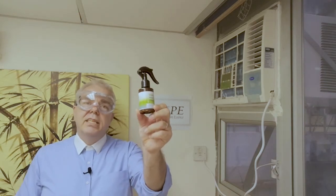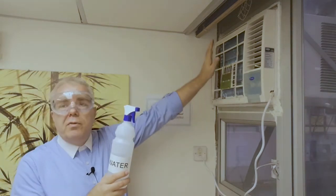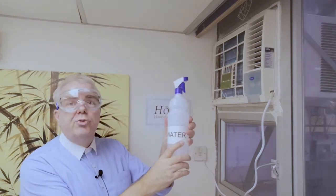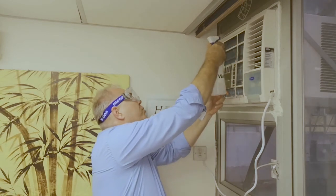Now we are back. This is Richard again. We are now ready after 20 minutes to clean your aircon. One thing I forgot to mention is that in the bottle, although it's 100 ml, you actually have 10 ml of tea tree oil inside — that is natural and helps you clean the aircon. But we have already sprayed it, so now we just use normal water to finish the cleaning. If you have a machine, make sure it is a low pressure sprayer, or you can just use the hand one. So we now spray the water on the metal parts.